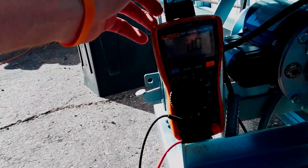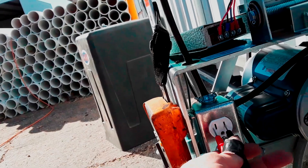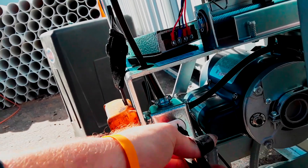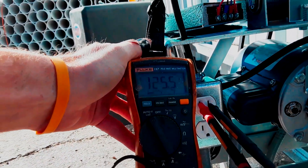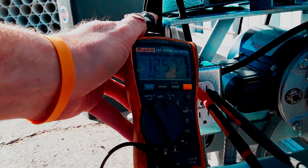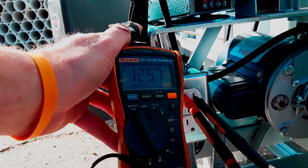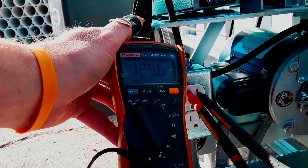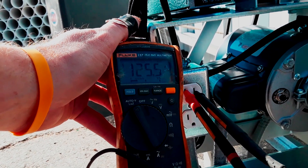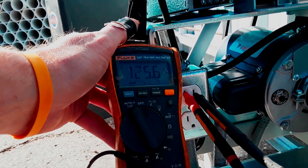On incoming voltage for an AC line, five percent over what it's rated at is probably okay. So 126 volts — it's a little bit lower than it was yesterday when we tested it. Yesterday it was 127 volts, so it's probably fair to say that's acceptable. You can check with a qualified electrician and they can tell you what the downsides are to having high voltage, higher than what it's spec'd at.